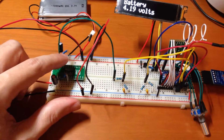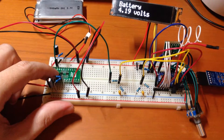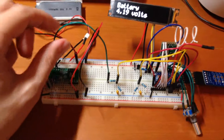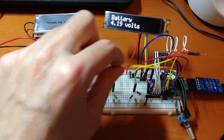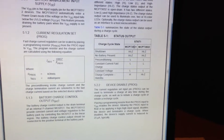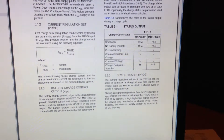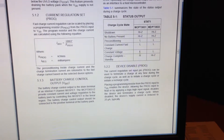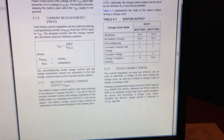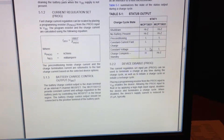Since I didn't really care about detecting the high impedance state specifically, I put a 10K resistor on that pin to pull it up to high when it's in its high impedance state, so I just turned it into either being high or low. I read that with the green line coming to the voltage divider and then going to the microcontroller with the yellow line. Looking at the datasheet for the charger: when it's shut down or no battery is present it goes to high impedance, when charging it's set low, and when finished charging it's set high — so there are actually three states, but I simplified mine to just high or low.